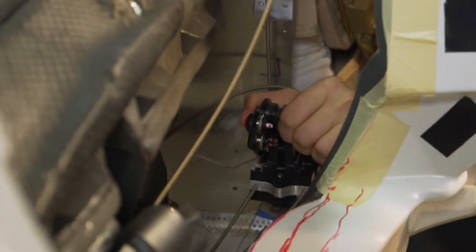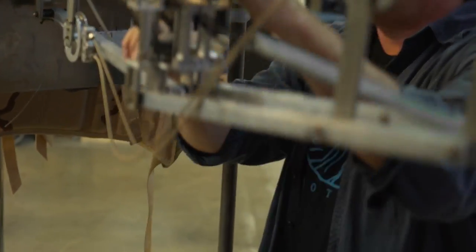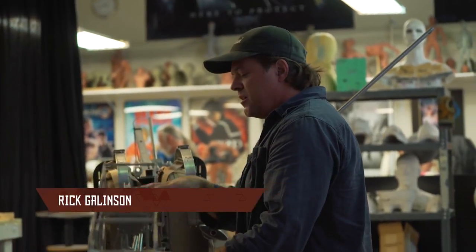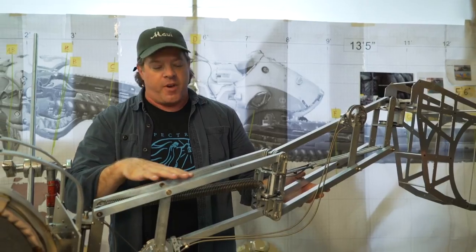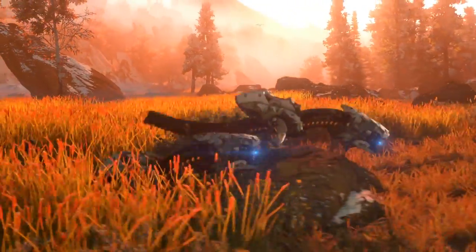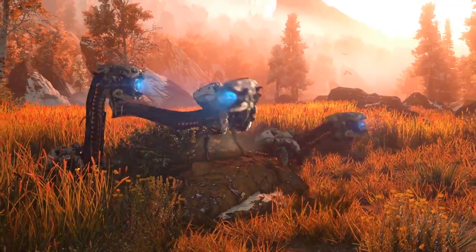We're going to have the controls in the costume and they'll be able to interact spontaneously with anybody at E3. Inside the foam construction of the neck, there's a mechanical structure that helps support it. As the neck goes up and down, there are two parallelograms providing a perfectly symmetric movement so the head stays parallel with the ground, as if an animal were tracking a target.